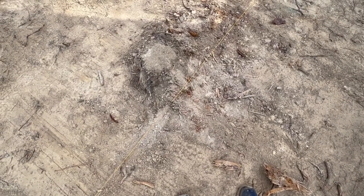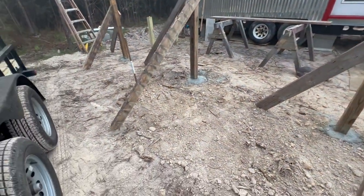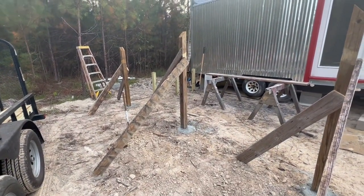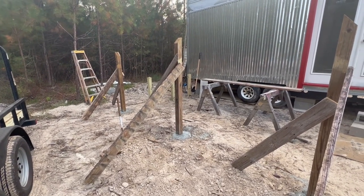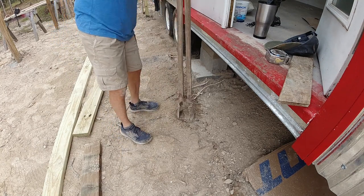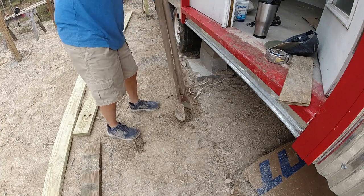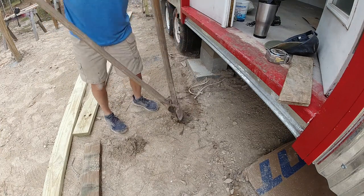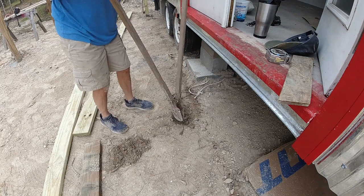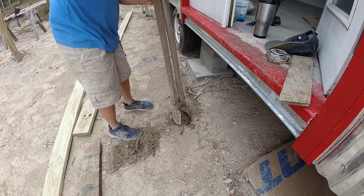It's Sunday, a new day. I'm going to take these little braces off the columns. There are no stakes on them, but they're a huge help holding the column straight enough to get concrete in the hole — once you get a little concrete you can dial them in with the four-foot level. Hard to believe how soft this ground was six or seven weeks ago. Some drainage and five weeks with no rain and now it's hard as a rock. Actual time digging this hole — only about 14 to 16 inches deep — was six minutes.